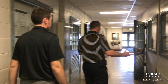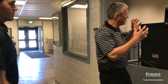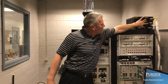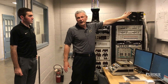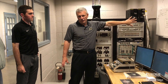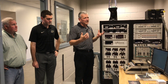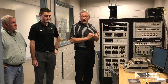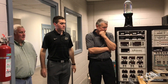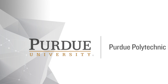We're going down to the F109 lab or test cell area. Now we've got proof of concept in the PT6, so we can bring that same information and those same mini controllers down and hopefully extract the information we need out of these EFCUs — the electronic fuel control units on this particular engine. Most of the industry would refer to them as FADEC. We want to be able to take that information out and basically get rid of this control system here, which was late 1970s to early 1980s technology. When we design our next shoebox project to go over here, it'll basically be talking to that electronic control unit, and that's how we'll control the engine from there.